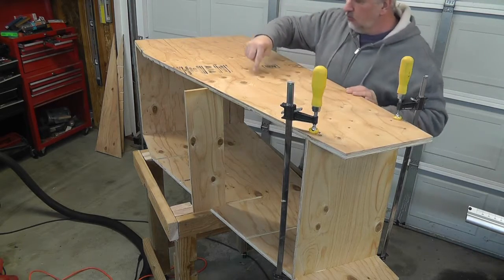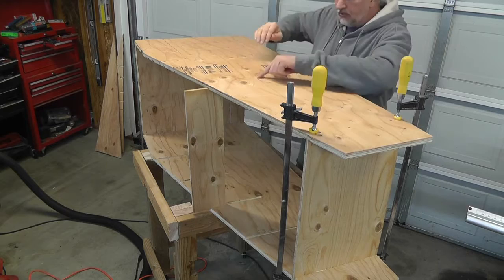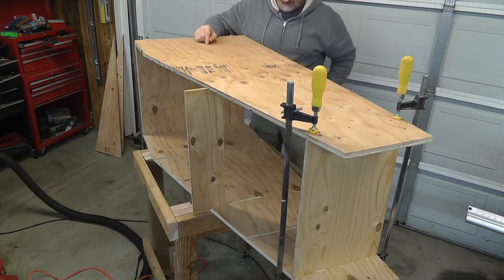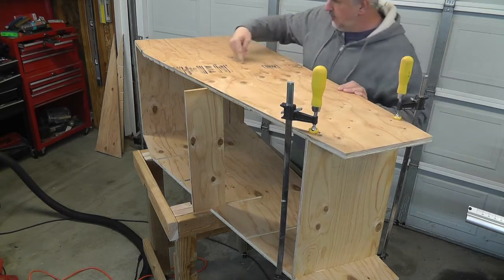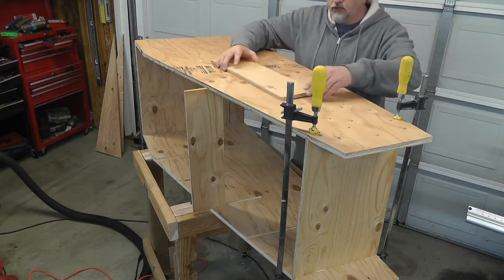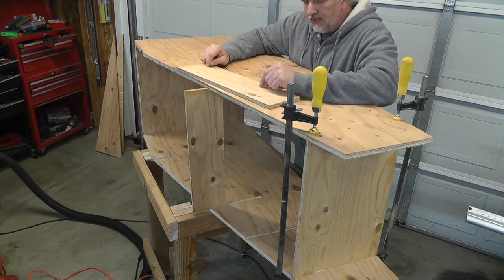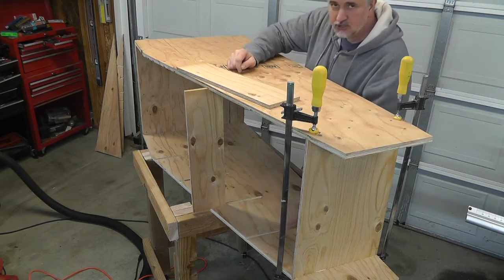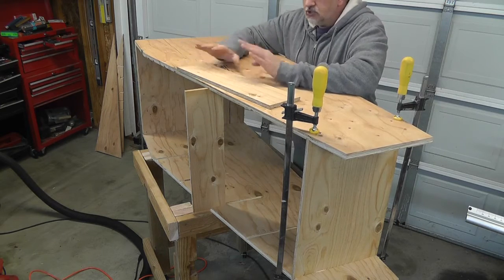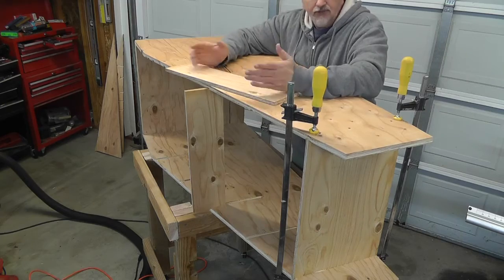There's really no pattern I used — I just put a small bucket down, traced the curve, put a straight line, and connected them. So I'm making a vertical oval, a horizontal oval on each side. I'll do the same on the other side, drill a pilot hole, take my jigsaw and cut these out, then install the rest of the shelves. I only cut 5.5-inch deep shelves because thinking about it, making the dados 9 inches long creates the same problem of stuff getting buried behind other stuff. Five and a half inches is plenty deep enough to hold lots of tools without getting things buried.